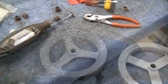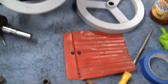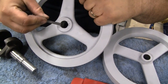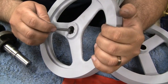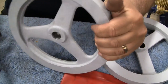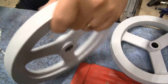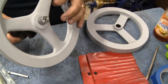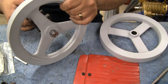All right. Yeah, Mike got the little Dremel out here, a little drum cutter. Like I said, there's a weld right here, and I had the hardest time cutting that on my lathe, and there was a little high spot, so we took the little sanding wheel and ground it down a little bit. So now we should have no problem. Wrong side, wrong way. Man, there we go. Yeah, that's good. It's got a little bit of clearance, but enough.